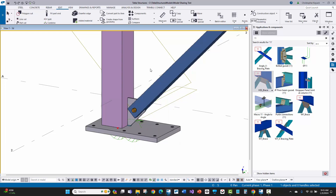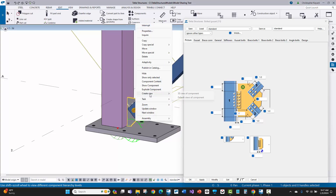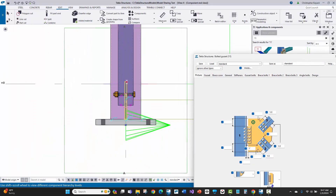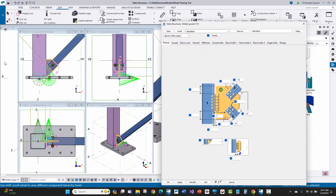We'll go ahead and start modifying. I'll change my selection back to 'select component' so I can click anywhere on that gusset plate connection and double click to modify the properties. One of the first things I typically do to get into a view where I can measure things is select the component, right click, choose 'create view,' then 'default views of components.' This creates four basic views; I can restore down to see all of them.